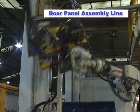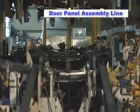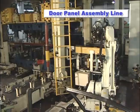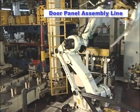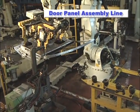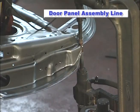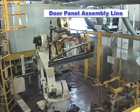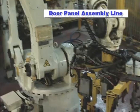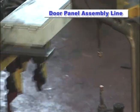When the application of adhesive is finished, the inner panel is placed on the outer panel and the two panels are hem-joined by the hemming press. The Kawasaki DX-165U Robot takes the joined door panel out of the press and manipulates the assembly in front of the stationary servo welding gun to add additional spot welds. As the electrode begins to wear, the robot sharpens the worn tip with a cutting insert fitted into the robot end-of-arm tooling.